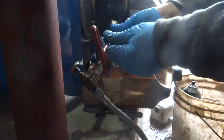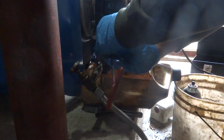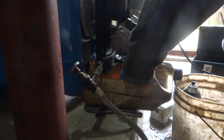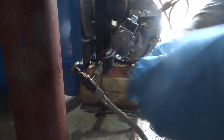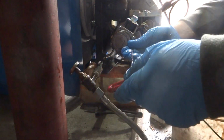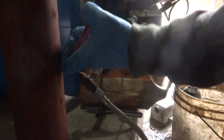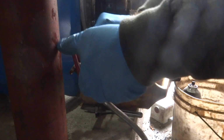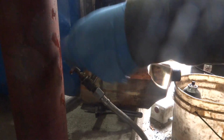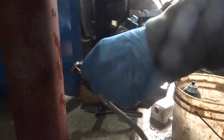So I thought it was going to be an oil flow issue. But while I was in there and I had some carbon on that head, I changed the nozzle too while I was in there. I do have new gaskets for this Riello, new filters and O-rings in the truck. I should, but sometimes you could just clean them, put it back, see if it works. If not, we'll put a new one in there. Ain't the space shuttle. Ain't rocket science.